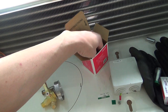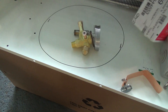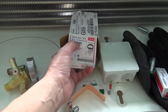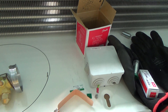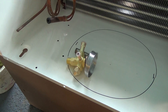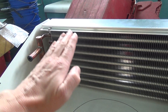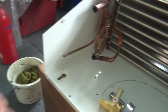These evaporators can be used with various different refrigerants. They don't come with an expansion valve fitted, so you have to get one to suit. We're going to try and run this on 513A, which is a replacement for 134A — it's got about a third of the global warming potential. So we've got to mount this in here somewhere where we can get all the connections made, get all the pipes out, and not impinge on the fan motors at all. But this one's quite a bit deeper — the coil's higher up, so there's more space; probably another inch and a half to play with compared to the last one.